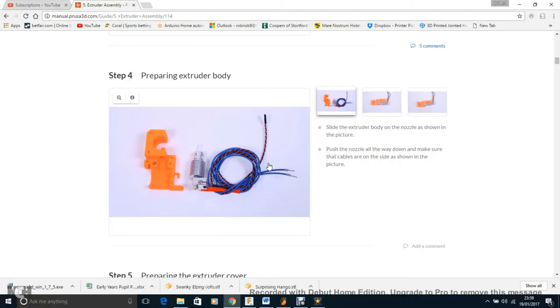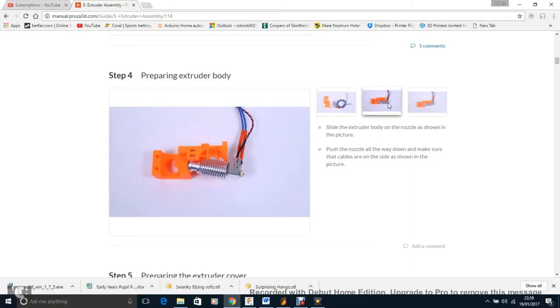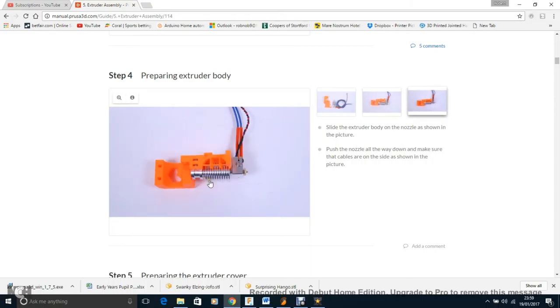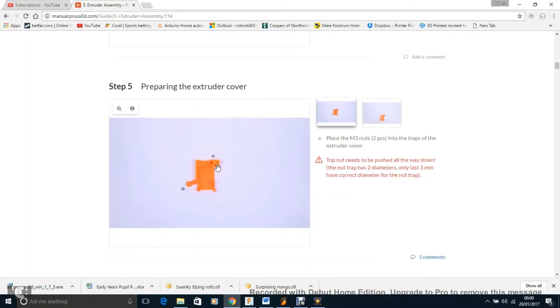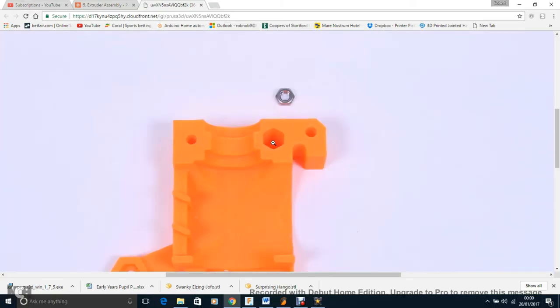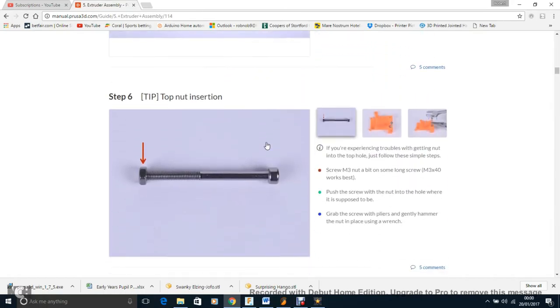Step four: you have to push the nozzle quite hard to get the PTFE tube through the hole. You're pushing this in and it kind of 'thunks' into place — not necessarily a click, but it suddenly settles. On the far side it should be flush with that surface, and you'll know when it's in place. Make sure it's parallel with the plastic — you don't want the nozzle at an angle. For the deep nut, push it all the way down so the screw can bite into it. Use the method from the beginning: screw a screw into the nut, push it all the way down, then unscrew it.